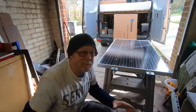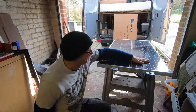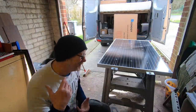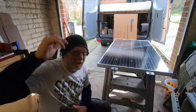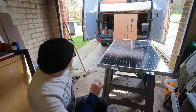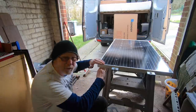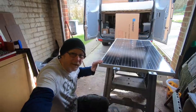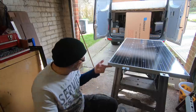The other good thing is it's easy to remove as well. Well, not that I want any poachers to nick my solar panels — that would be embarrassing. The good thing is they're easy to put on and easy to get off. Maybe the easy-getting-off part isn't such a good thing, but it's so high up, I don't know if anyone's going to get up there and nick my panels. Now, there's one other job I need to do before I put this panel on the roof: put some soft felt pads underneath. If my measurements are correct, it's going to be quite close to the roof of my van, and I don't want it vibrating and touching the roof.